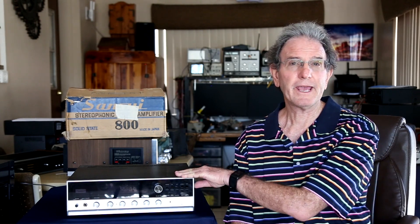Welcome to another episode of Vintage Audio Review. In this episode I'm going to talk about the Sansui Model 800 AM/FM stereo receiver. This sold between 1968 to 1971 at a cost of $260, which would be about $2,100 in September 2023. It was rated at 22 watts per channel into 8 ohms at not more than 1% THD, and 28 watts per channel into 4 ohms also at not more than 1% THD. It was one step up from Sansui's bottom-of-the-line receivers in that time period and had an option for a wooden case.